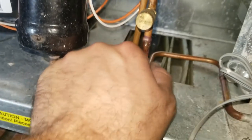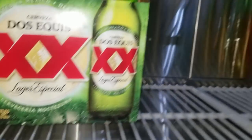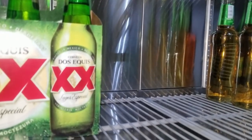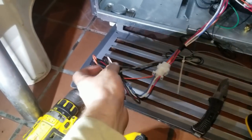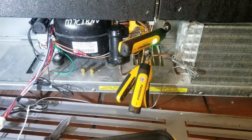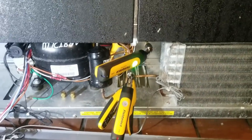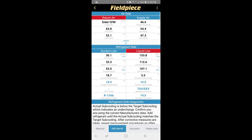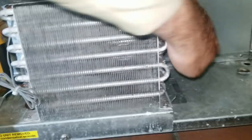I want to make sure that the discharge line is hot. I'll see if we notice the difference in box temperature. I just want to test to make sure there's nothing else wrong before I order the control. It's jumped out and running — I've got pressure probes on there and probes inside the box. It looks like it's working. Condenser is nice and warm.